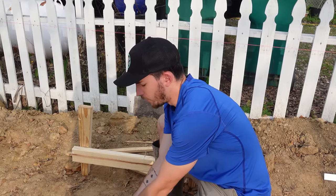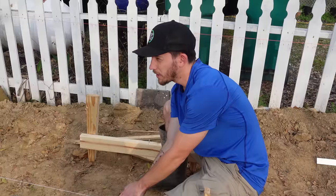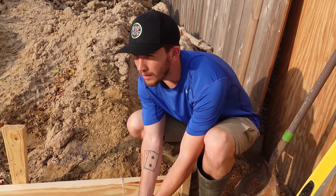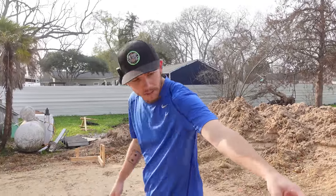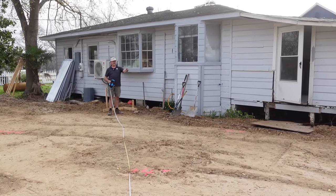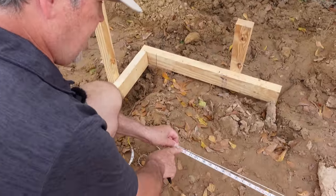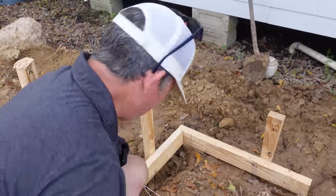I'm at the front right corner with the one-foot mark on the Sharpie line; dad's across the corner at the hypotenuse measurement of 42'8-7/8". Marked. Now the back corner — I put the one-foot mark on the black Sharpie line again and dad pulls 42 feet 8 and 7/8 inches. That gives us two black Sharpie marks we can connect to form the back string. This should give us 32 feet between those two marks. We check it live on camera — burning a foot — and it reads exactly 32 feet. Pythagorean theorem wins again.